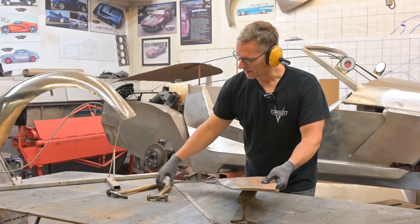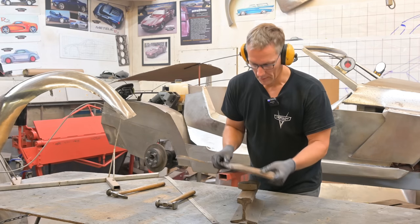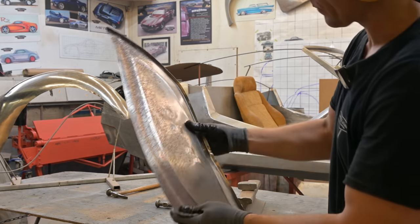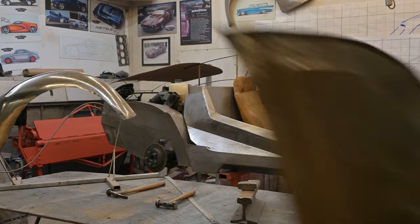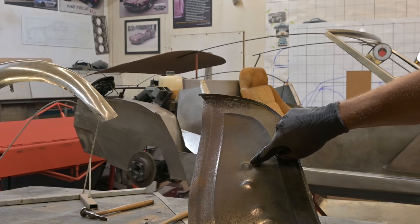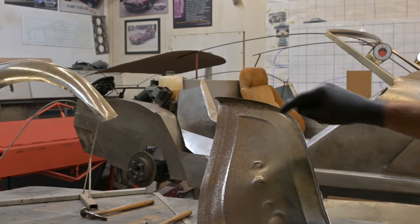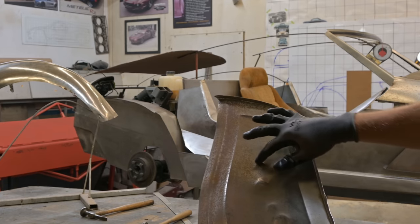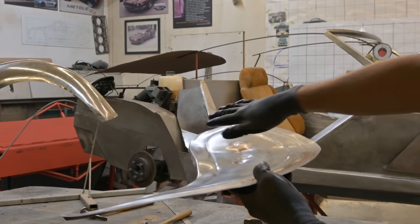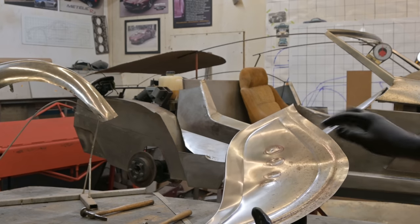Let's get a heavier hammer and strike directly in the center of that bump. There we go. Now you can see where I struck it with the hammer — that drove that center point up. But we had this extra material around the perimeter of that little impact area that stretched, and that's what has to shrink. By doing this single strike we've already improved the panel's original convex shape. So let's strike this three more times, correct those, and see where we go.